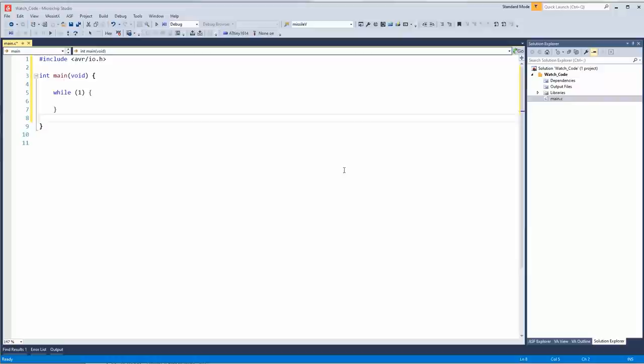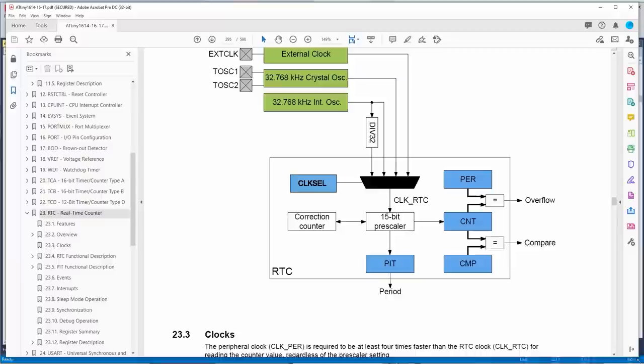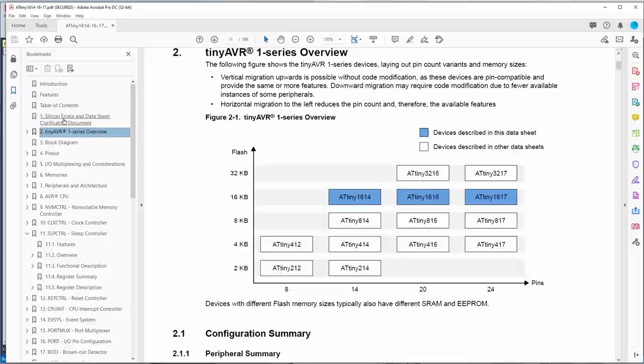So on my second monitor, I've got my giant cheat sheet, which is all the code that I already wrote. All right, so you saw that I had a little LiPo on there. I've also got a 3.3 volt regulator, a very small one made by Microchip. Microchip actually makes a lot of other things besides microcontrollers. So something we need to think about with that: if that's 3.3 volts, that's probably going to affect the speed. Of course I know it's going to affect the speed. Why am I being coy about it? So we're going to look here in the data sheets.